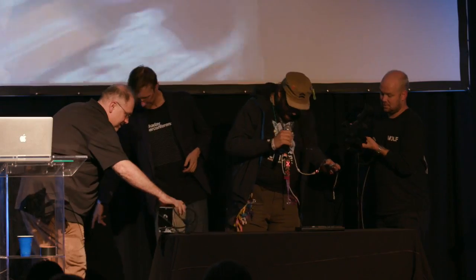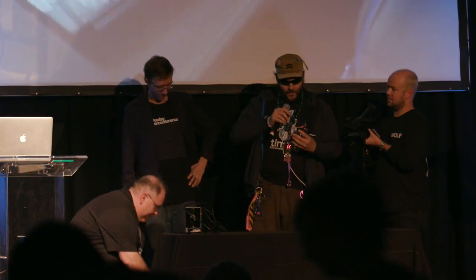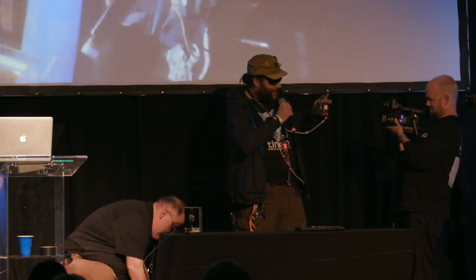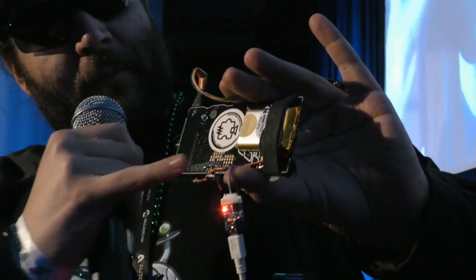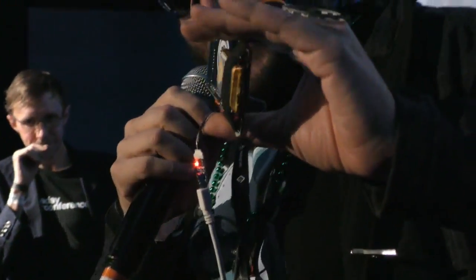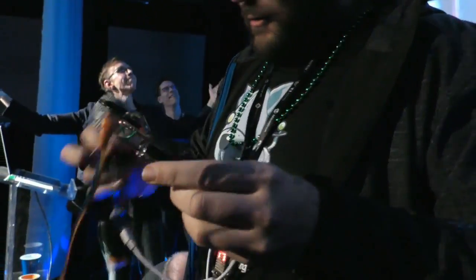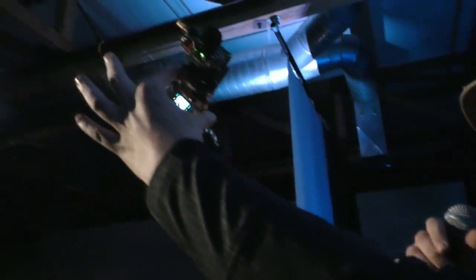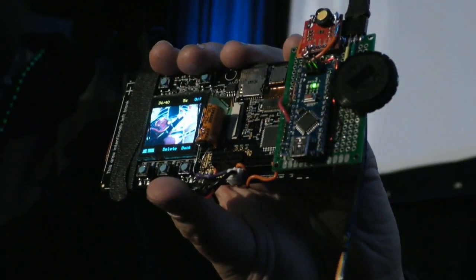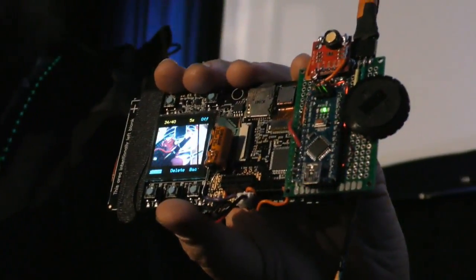Thank you. I've got a few hacks on here to show you. I think I call this kind of the Swiss cheese, Swiss Army knife badge hacks. Start with remove the batteries and put a rechargeable lithium on there, which is currently being charged by my pants. So we'll go ahead and disconnect that. So we're wireless, which is the second hack. So the header's here. I added an additional breakout header, which lets you charge, and there's an ESP module that snaps in there when you're not in a room full of hackers with crappy Wi-Fi. Although the internet here has been great.